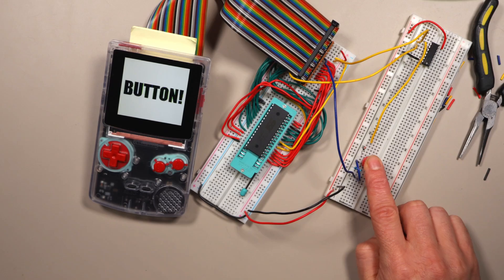Of course this won't work with arbitrary ROMs and will probably cause problems if a ROM ever tries to write to cartridge RAM, because the logic I'm using won't differentiate between a read and a write from cartridge RAM — so it'll try to activate the button and send data onto the data bus regardless. But this is pretty neat and it goes to show how flexible the Game Boy can be. You can really add whatever you want as long as you get the logic right and carve out a space from the memory addresses. Hope you found this interesting — maybe I'll do some more silly things with this cartridge in the future. Let me know in the comments if there's anything you'd like to see hooked up to a Game Boy!